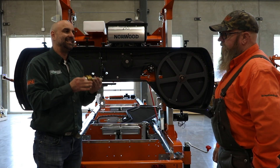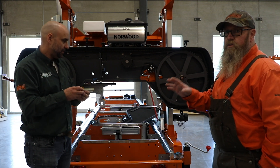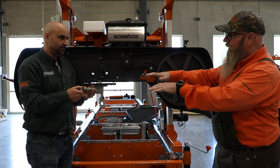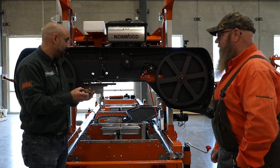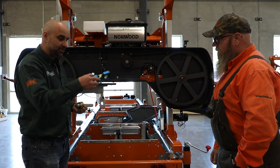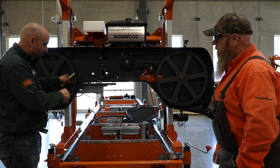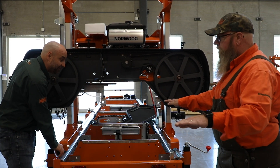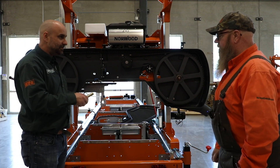That tipping is what's going to allow us to adjust the lead of the blade — controlling the pitch and angle of that blade as it's going straight across your cut. Blade lead gets talked about all the time, but not everybody totally understands what it is. There are a few different ways to adjust it. Sometimes I'll just use a quick torpedo level. You put the level on your actual sawmill track, check that your track is perfectly level, and you see the bubble perfectly centered.